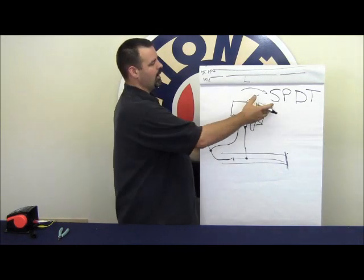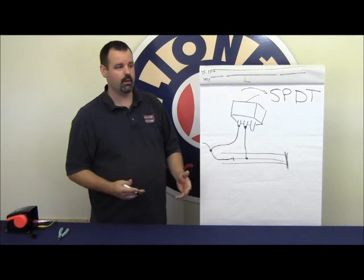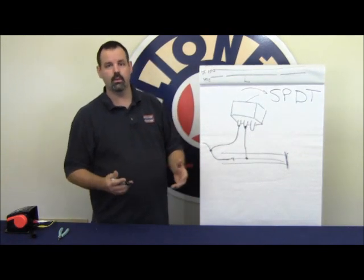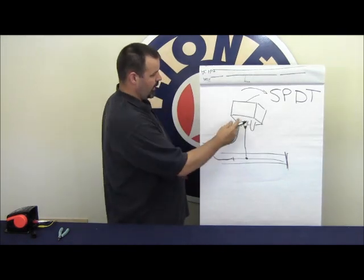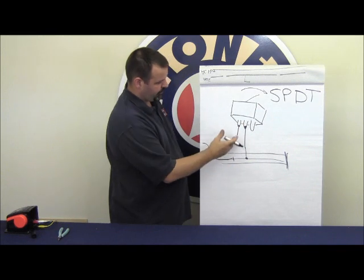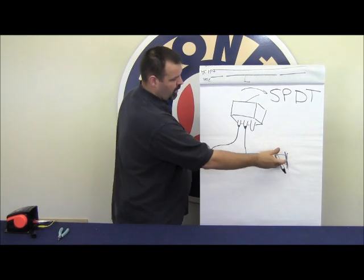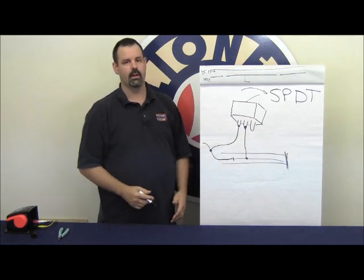So I would actually recommend getting just a regular single pole double throw toggle switch from Radio Shack or Mouser or DigiKey or a similar electronic store, electronic reseller, and use that. The on-off, very simple. You can turn power on here, complete the circuit, turn power off, the train stays stationary.